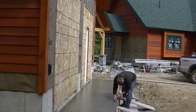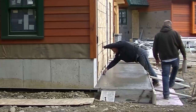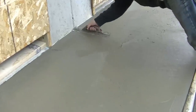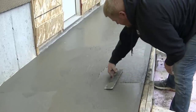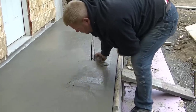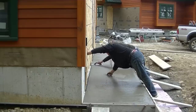This was probably about an hour later. It's starting to set up a little bit — we're waiting for the bleed water to dissipate, but it is firm enough to hold its shape now. Darren's just putting an edge on it, rounding the edge off a little bit. The homeowner also wanted to edge the back so he could put a bead of caulking right in there and keep water from getting down between the garage and the apron. The concrete mix was pretty good — it had a nice paste to it, easy to mag float, and you could really work up a nice cream and get a good finish on the surface. We typically mag float the surface twice to get a nice tight broom finish.